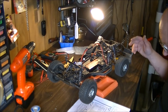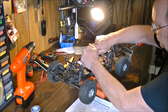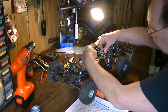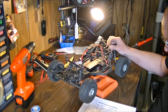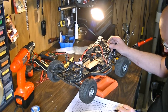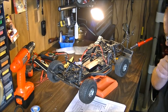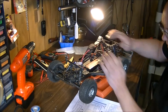Drag brake force can go up to 20%, so we'll set the drag brake next. Hold the button, turn your power on, first beat, two beats, let go. That's it — I've set my drag brake to 20%. Unplug and plug it back in.